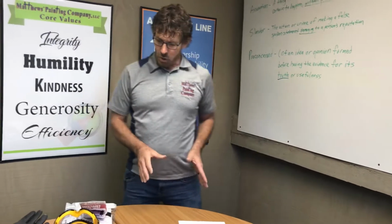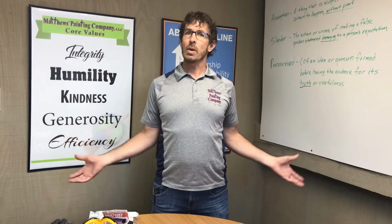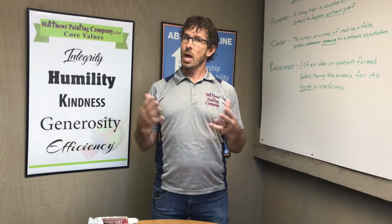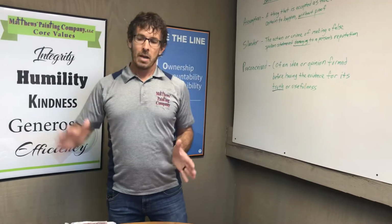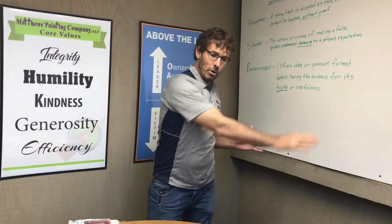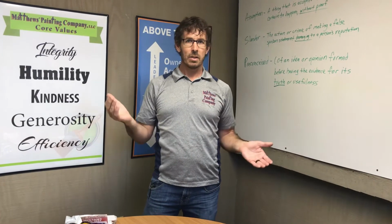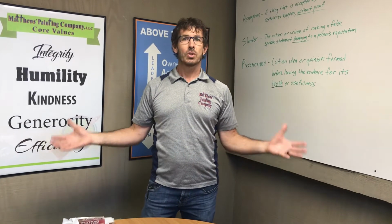So when that happens, we do a couple different things. When we go back to actually wash the home, we can't pressure wash it because there's no way we can contain all the lead chips. So we actually have to hand wash, and it takes a lot longer and it costs more to have that done, but it's safer. And we also have to drape plastic out about 20 feet or so, and those laws change with the EPA constantly. So that can change even from the time you watch this video. And we catch all of the paint chips.